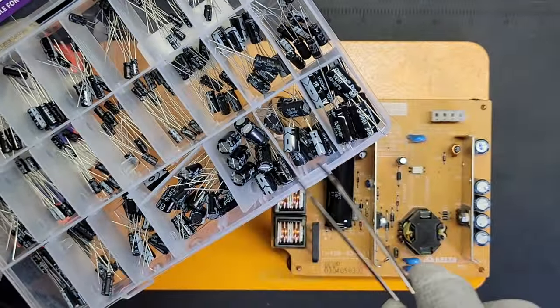It's below that - this one and this one. Not that it matters, it's still zero. Let me make sure I have the correct polarity - yes, that's negative. So that might be a problem right there - that capacitor doesn't measure anything. Let's check the others - these are 680 microfarads and this one's 470 microfarads down here.